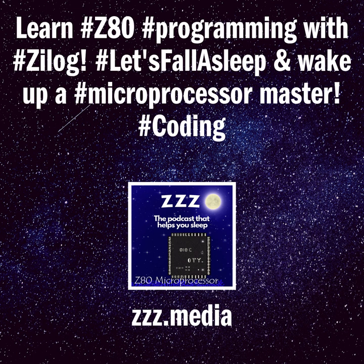Designed as a superset of its popular predecessor the 8080, the Z80 offers enhancements which remove almost all of the objections to the programming characteristics of the earlier machine. It has a flexible, powerful instruction set which allows it, in skilled hands, to perform tasks of any significant size and complexity in substantially less memory than competitive microcomputers. With a single minor exception, its binary instruction set is a superset of the 8080's, allowing software developed for the 8080 to run unchanged on the Z80 — an important consideration when contemplating a machine upgrade.